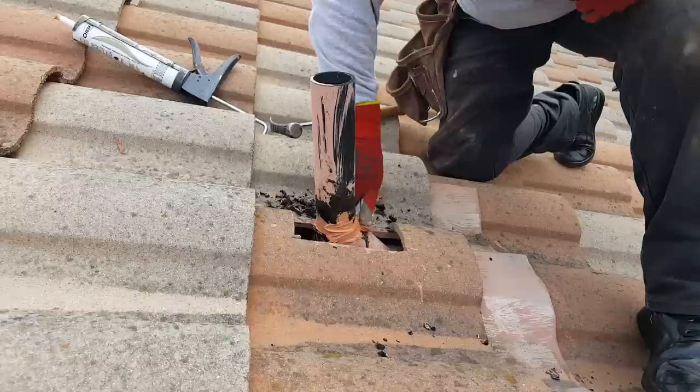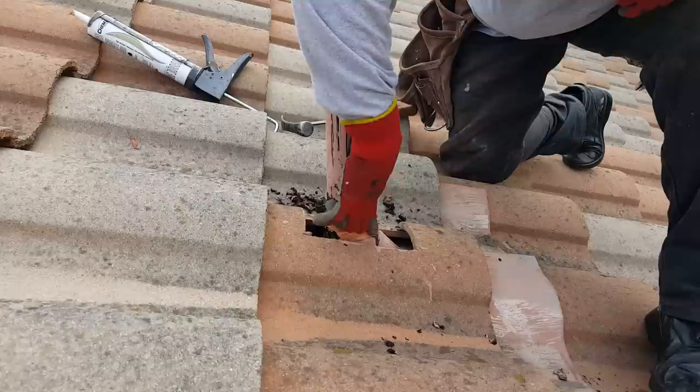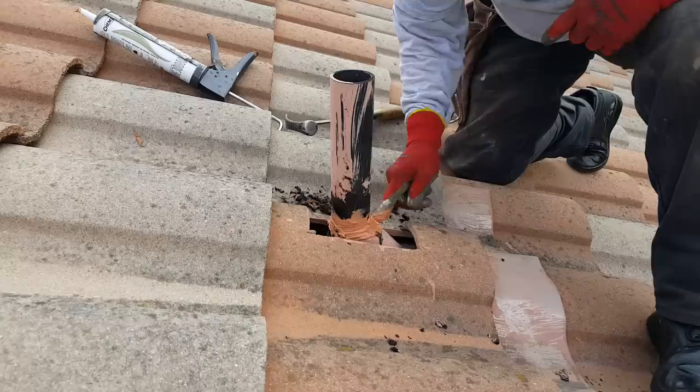This is a product made from ChemLink. It's a polyether-based sealant, terracotta to match the tile. Put this stuff on once and put it on really good. Make sure you remove the old first. And this stuff will probably stay on here, I bet you, maybe about 20 years.